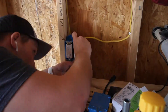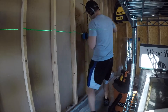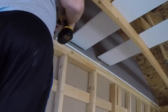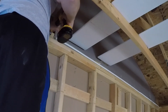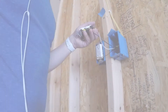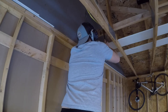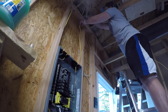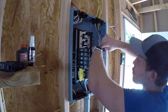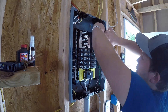I talked a lot about the plan for the wiring earlier, as I realized it would be difficult to get a real sense of what I was doing from single close-up wiring shots, but we can still go over a little bit of that too. One of the tools I splurged on was a laser line level to help get outlets perfectly aligned on each wall. I also found a right angle attachment for my drill super handy to drill holes for the Romex in the double top plate of the walls with a spade bit — holding the drill away from the wall was a lot easier to control and saved my knuckles. Since this was the first time I wired a panel from scratch, I did my best to be super tidy, making all my wires bend at right angles for a nice neat appearance that a future electrician or the next homeowners might hopefully appreciate someday.